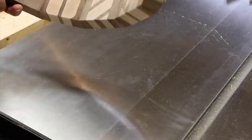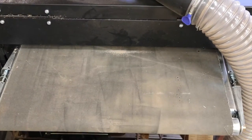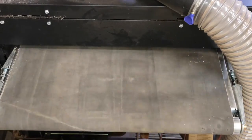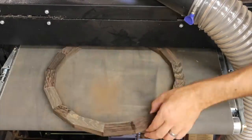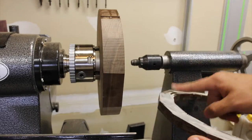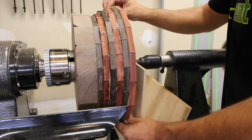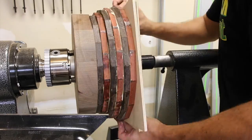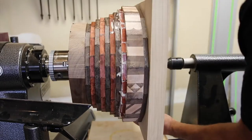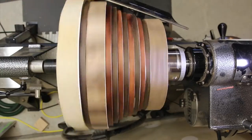Here you can see it — for this one it's a little bit wider, so we used two steel clamps. Now we're working on the actual base, which is just a few pieces of glued-up walnut, but it works out pretty well. Now that you've got all the individual pieces, we can take everything to the drum sander. It's very important for every piece to be the same size, length, and thickness. The drum sander does a great job of making sure they're all the right width so it all goes nice and smooth with no gaps and no seams. One of the easier ways to do the clamp-up — which YouTuber Kyle Toth is also a fan of — is doing the clamp-up on the lathe itself, one piece at a time. It ensures that once you get the thing spinning, everything is referencing off the same point. Works fantastic.